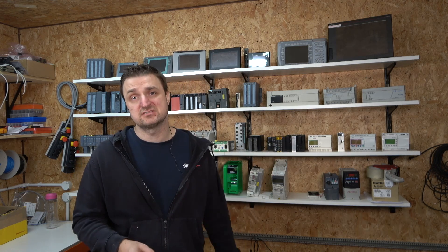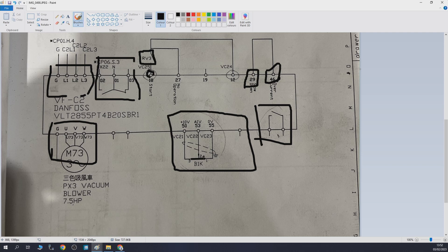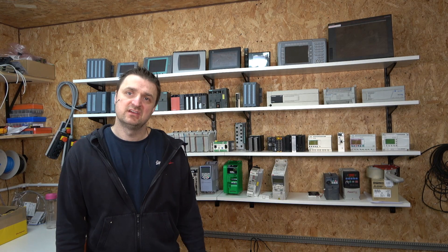I'll remove those wires and just put an overload inside the drive so it can trip out if current reaches an unacceptable level. Having known all this information, I realized that little potentiometer visible here goes back to the front of the machine as a 0 to 10 volt control. This is where you need to be friends with your operators — they run these machines day in, day out and can guide your decision making. Don't think you know everything better than everyone else.